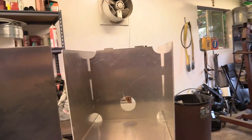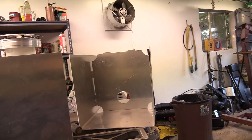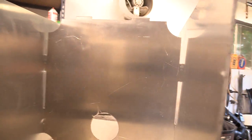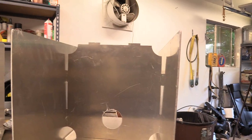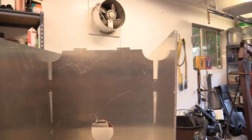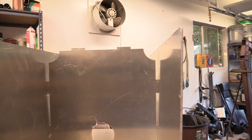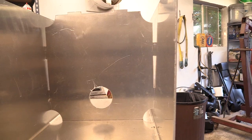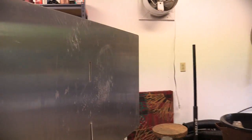These are tanks I bought from RSR. They look pretty good. You have a center section that keeps the momentum of the fuel from pushing the boat around, so there's a divider in there. Holes on the bottom let the fuel equalize. They're notched out on the sides and that center piece has notches that go into them. You clamp that together and they semi-weld it up. They stick out so there should be some metal there to TIG weld with.